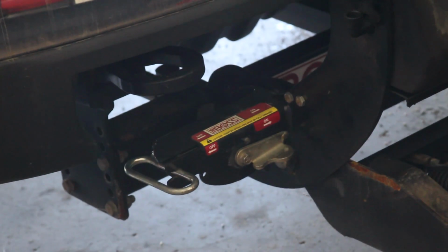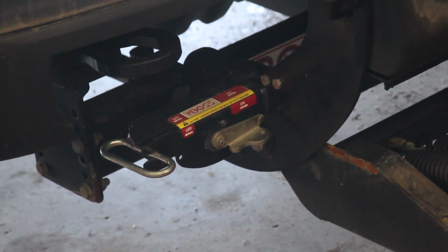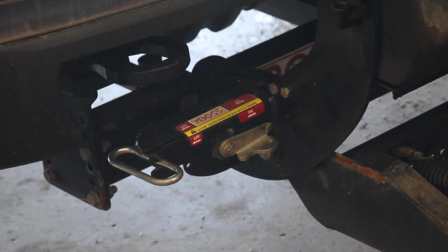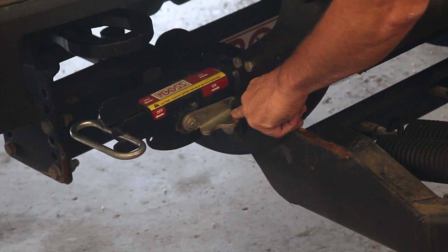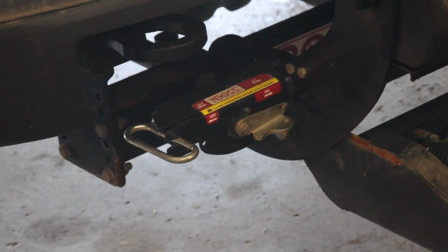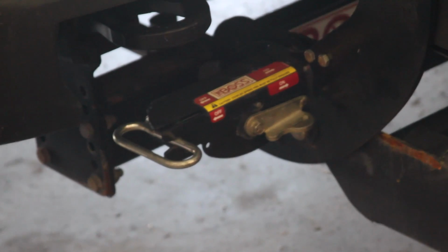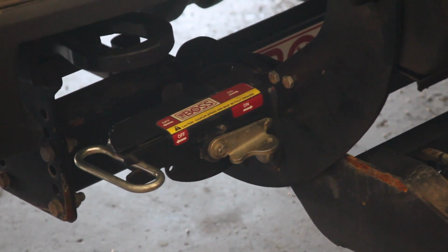It's a primary responsibility for the agency and primary driver to mount and dismount the plow. You need to check that and make sure that the handle's in and the lock mechanism right here is in the on position and pointed to the plow frame, so you don't lose a plow. There's one on each side, so check each side and make sure it's there.